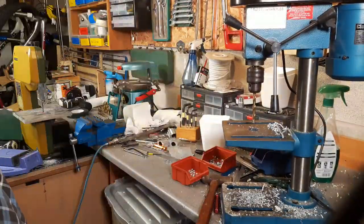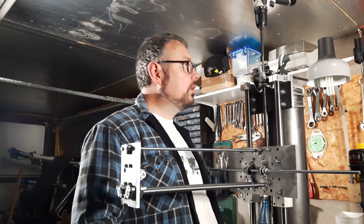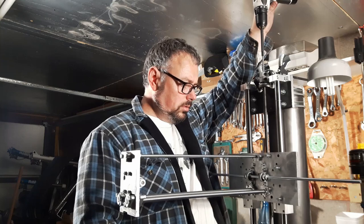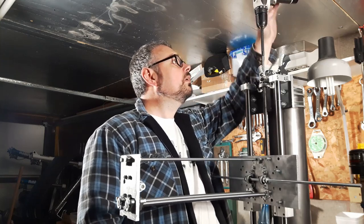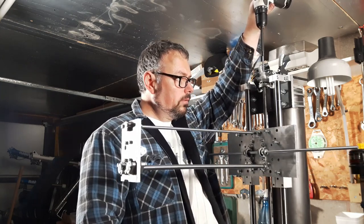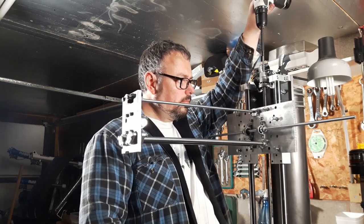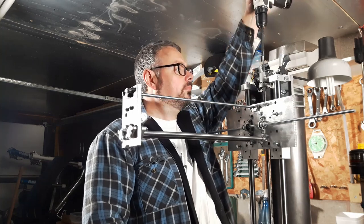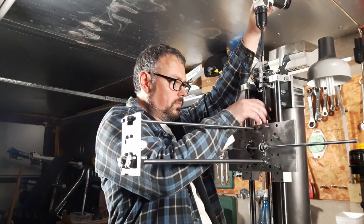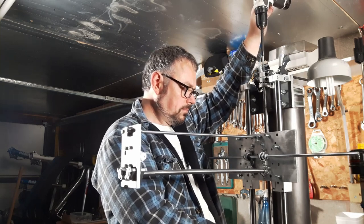Here we go — this is the last part of the build. I've assembled all of this and it's on the z-axis itself. As you can see it goes up and down. The vibration you're seeing is because that drill is very poorly aligned to the coupling shaft coupler — I think it needs going on the lathe because the hole in the middle of that coupler isn't right. There's also still some squeaking and I'm not quite sure what's causing that, but we'll figure that out.